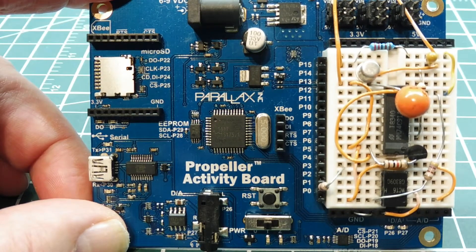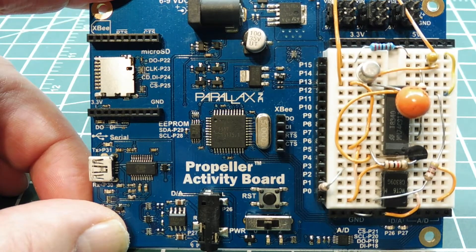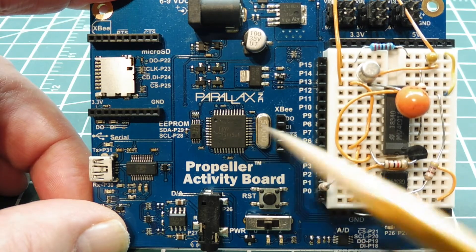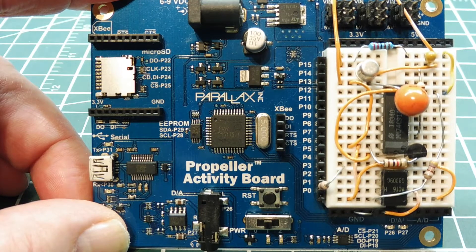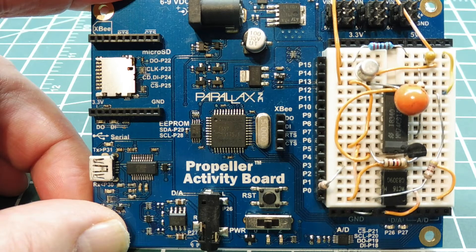In this video we're going to look at using a microcontroller to control a three-phase industrial induction motor. The microcontroller I'm going to use is a Parallax Propeller — that's it here on the board. This microcontroller is a multi-core microcontroller because it has eight 32-bit microcontrollers on board, so you could run eight separate tasks or programs independent from each other.